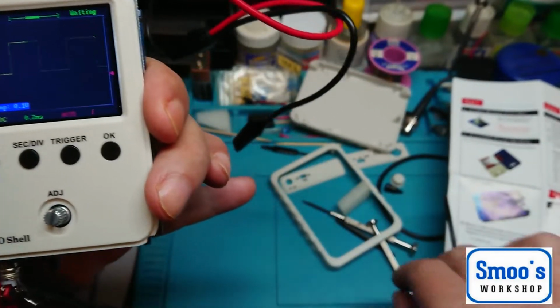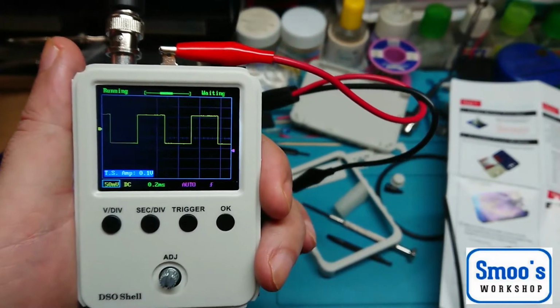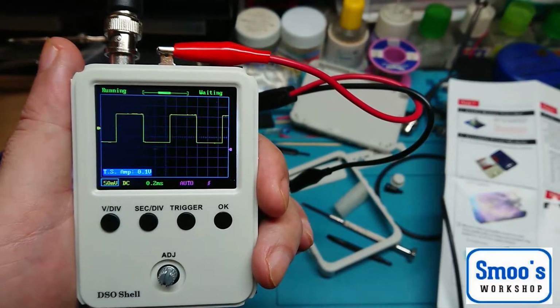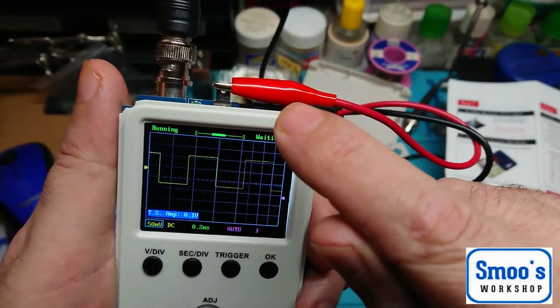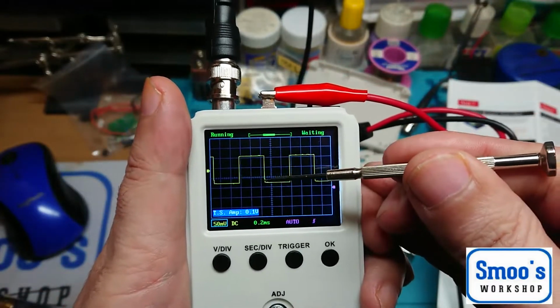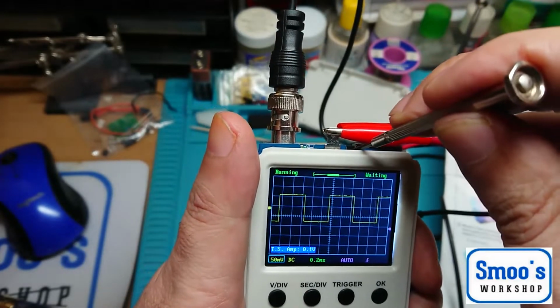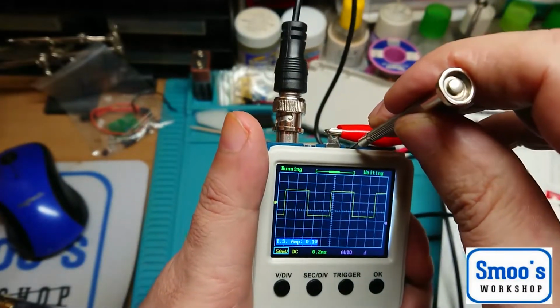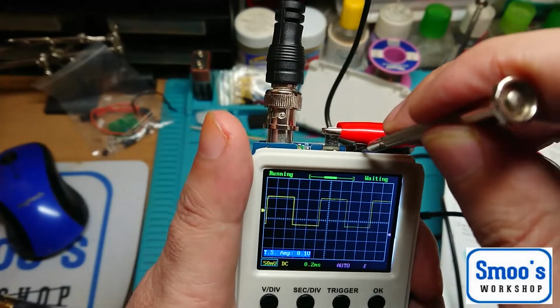So with a plain screwdriver, the capacitor that we adjust for the 0.1 volt one is capacitor 3, which is the one to the right. And all it does is we're wanting to try and square off this wave. So let's see if I can keep this on camera and show you this at the same time. So I'm going to knock it out of alignment if I can.